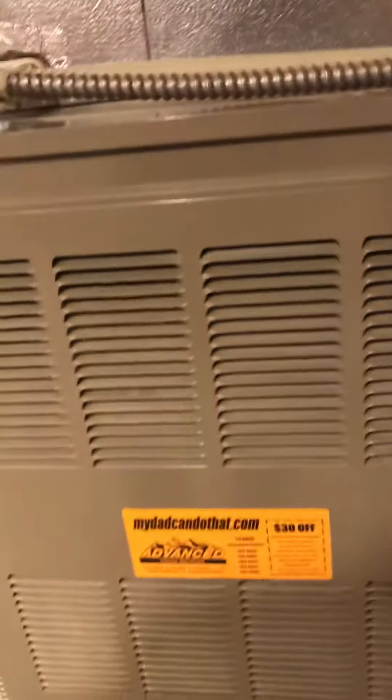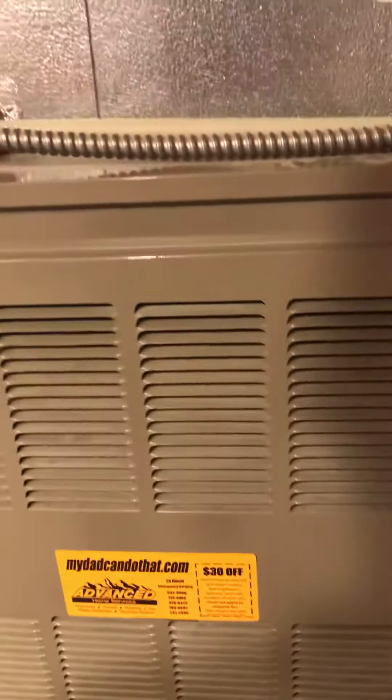Return drop is a good size. This should be kind of on a small base can, but we are limited on room going up to the supply. The new furnace will be a little bit shorter, so that should give us some room to work with and maximize the amount of airflow.